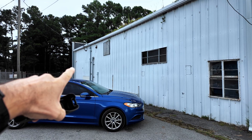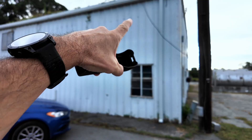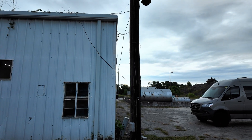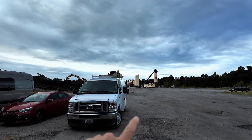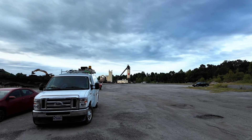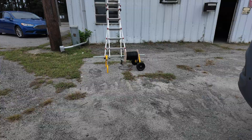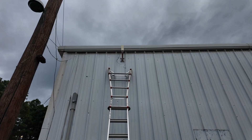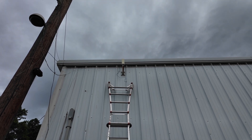The internet is going to be demarked up front in that building, in that office there. We're going to extend the data cable to here. We'll use that mounting arm to install a wireless unit and point it towards that building back there — that'll be the remote side where the internet is extended to. We've got that reel of outdoor cable set up and the extension ladder ready.